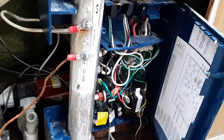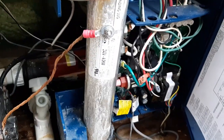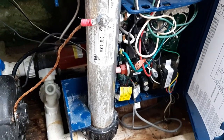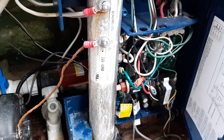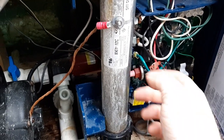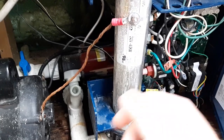We're going to change the pressure switch today. Before you do that, power off — there's going to be water in it sometimes, sometimes not. This customer has a flow issue; we already tried to adjust the pressure switch, and the heat came back on — you can hear the relay click back in.